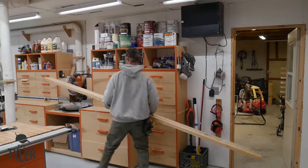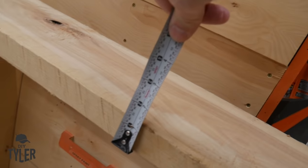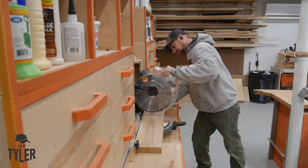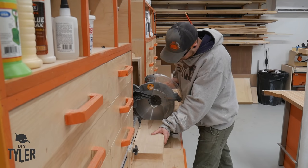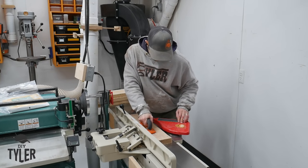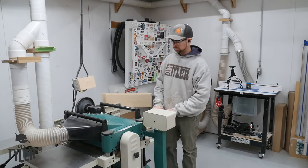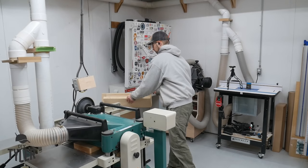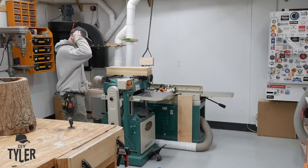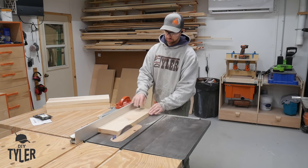While that epoxy sets up, it's time to move on to the second phase: the DIY cookie top. I have a beautiful piece of hickory about an inch and a quarter thick, and I'm going to form a slab and cut a round cookie out of it. I wasn't able to get an actual live-edge cookie top in time — there was one on Facebook Marketplace but I was concerned it wouldn't be dry in the timeframe. So it's this piece of hickory: I whacked it to dimension on the miter saw, then flattened it at the Grizzly jointer and planer with the helical heads — very nice finish on hickory.